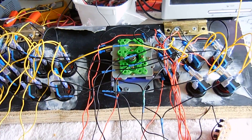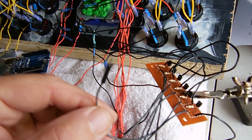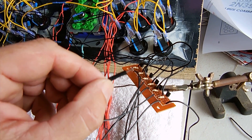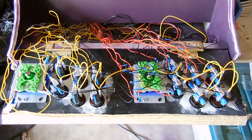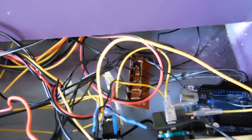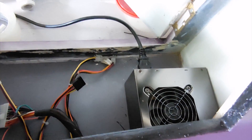Once I have it all programmed, I've just finished wiring this circuit, putting these pins on — they plug directly into the Arduino into the pulse width outputs to control the LED lighting sequences. I've got all the wiring done now and all the lighting. I haven't got the Raspberry Pi in there yet, just the Arduino sitting in there with the little board made up with the transistors and resistors. I've programmed the Arduino. I've just got a PC power supply in there providing 5 volts and 12 volts — 12 volts for the LEDs and 5 volts running the Arduino.